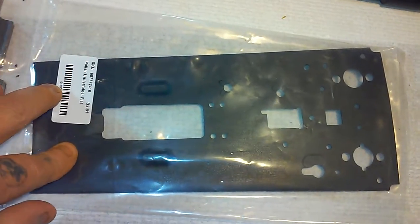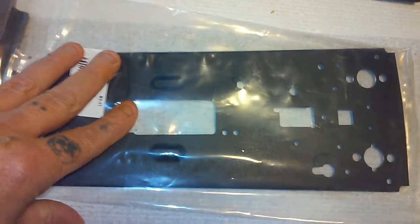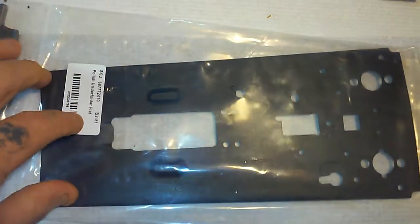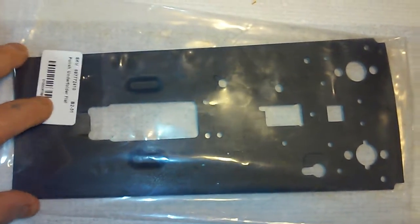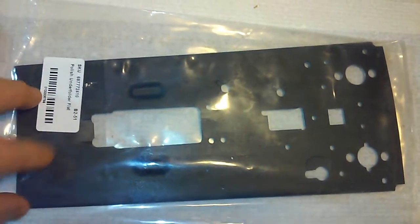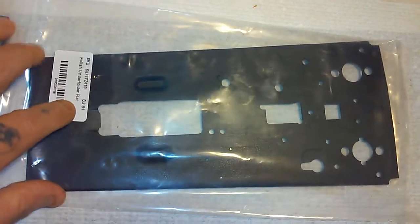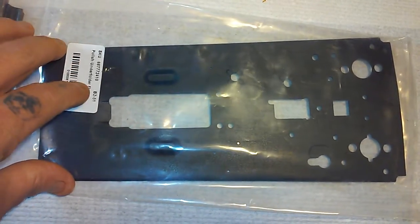They've got some kind of coating on these to help prevent rust. As far as heat treating goes, I usually go by the visual of the temperature of the metal. We'll see how this works out with it being black and not just bare metal, which will probably come off once I apply heat. But if I can't do it visually, I'll just use the magnet technique.